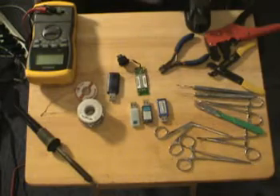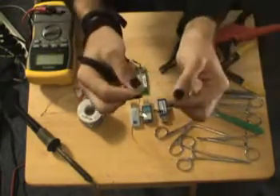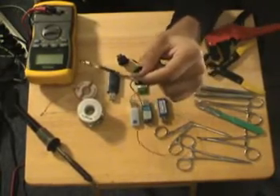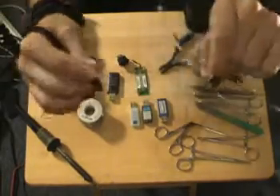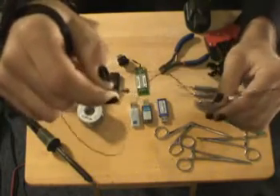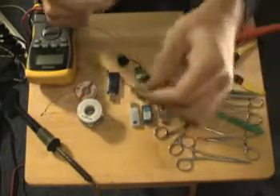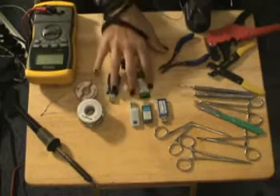You'll need of course some kind of coax cable. The cable I'll be using in this segment is LMR100. You can also use something called RG316, however it's only rated for 1.6 GHz — in short runs it will work but I wouldn't recommend it. This cable was actually sacrificed out of an old laptop. This connector on here is actually a UFL or Hi-Rose connector that plugs into a mini PCI Wi-Fi card. This is the antenna that actually went inside the screen itself.